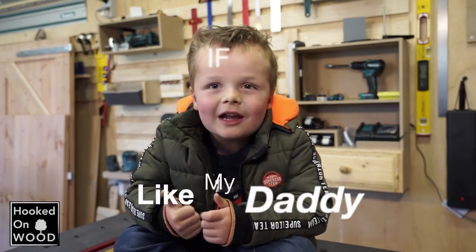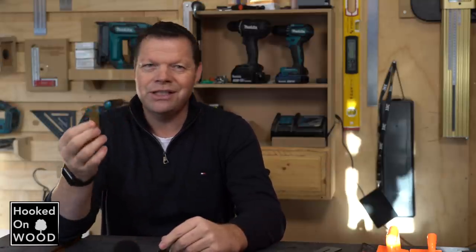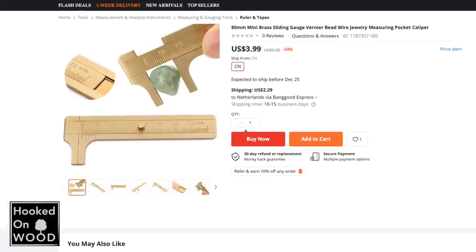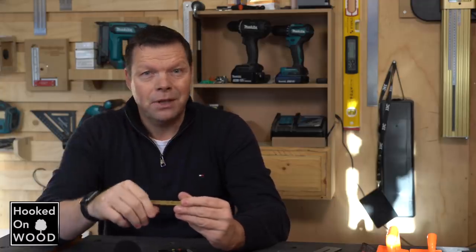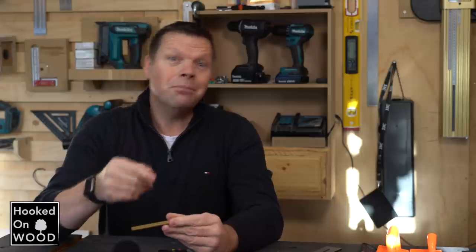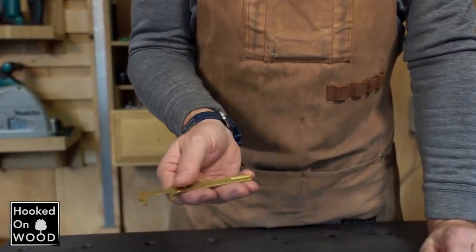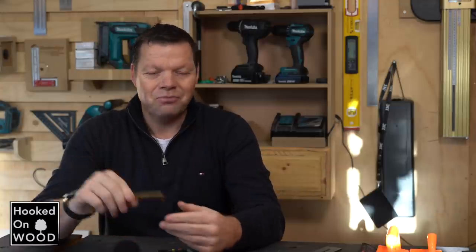Speaking of calipers, those who follow my channel know my son. So when I was searching Banggood for some new products, I came across this brass caliper. The price was very friendly, so I bought one for myself and for my son - mainly as a sort of joke to show my son that we have the same tools. I did not expect back then that it would turn out to be a very handy tool. I always wear it in my apron. For quick measurements, this is my first choice. There is a lot to say against it - it is made of brass, and that makes it perhaps too soft, especially if you put it in your apron with more tools. It has an engraved scale, and therefore it is not always easy to read.